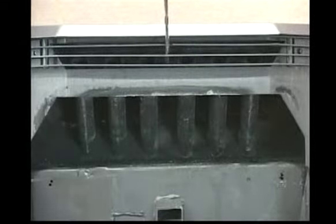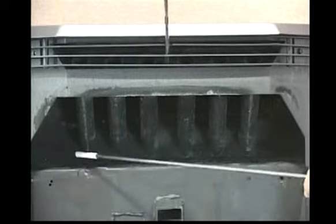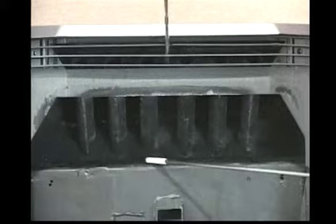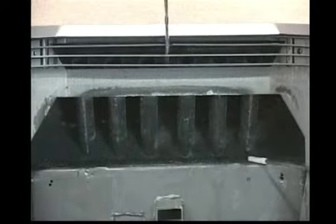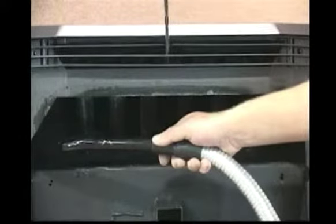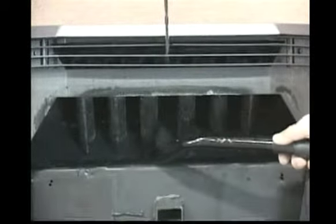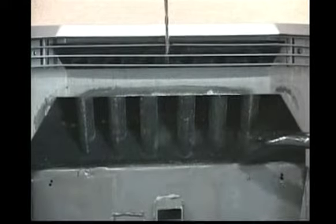When the baffle is out of the stove, the area where the fly ash accumulates on the firebox shelf will be clear. The use of a utility vacuum or ash vacuum is highly recommended because it will prevent fly ash from falling through the exhaust holes and into the exhaust chamber.